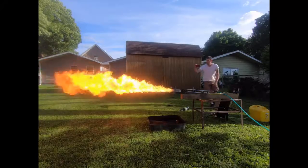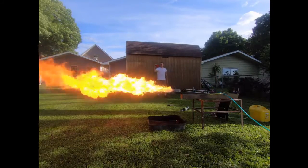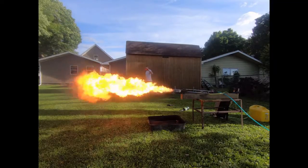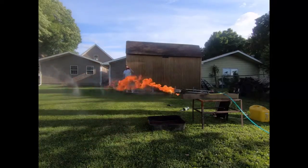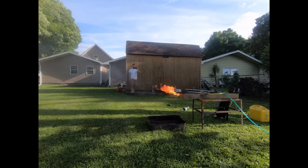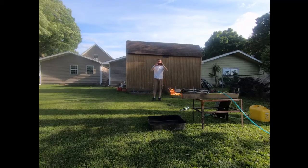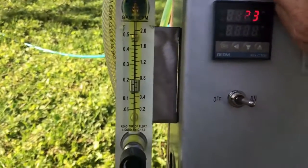Any pressure sensor or anything you hook up to an air compressor — that failure mode is not compatible with the simple flame-out mode. You still have fuel dumping out all over. So we had to put two different systems combined into one format to pull this off. As you can see, I just pulled the air hose and the pump shut off. Let's try that again — let's do one megawatt.